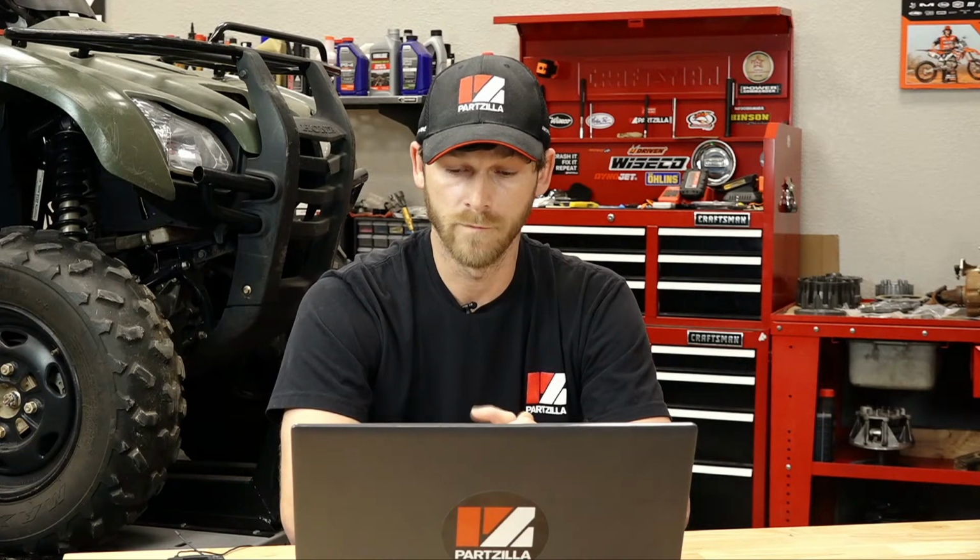Okay. All right, from Laughing Dog, it says, what's the best way to remove bearings? I've heard heating them helps to loosen them. Yes, it does help a good bit, but you also want to make sure you don't put too much heat on them, especially with an aluminum case, because when you heat it up and you jar it, you could just snap off pieces of that cast aluminum. So as you do heat it, do it slowly and evenly, and gradually increase the temperature, and it will help loosen them out.